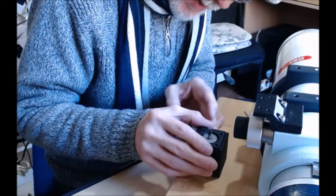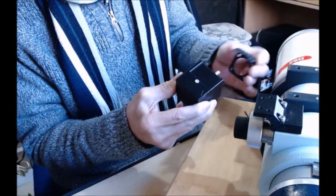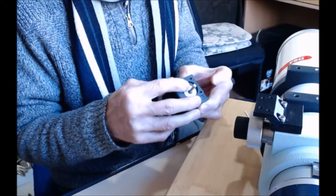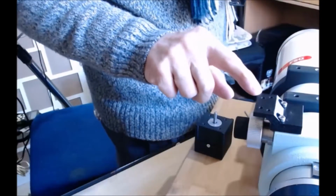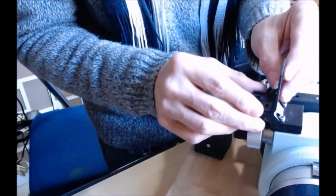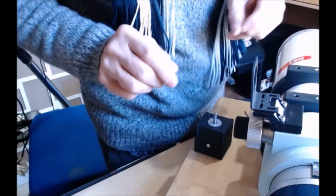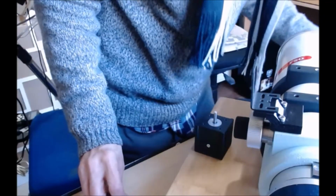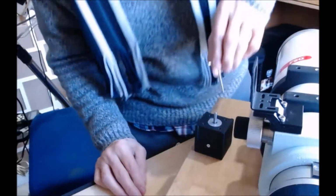Looking at that, there's a groove on the actual motor unit, a slot there, so that tells you that has to go in there, I should imagine. That would indicate to me that we have to put this bit on here first. And if you look on here, you should be able to see there are four drilled out or processed holes. They'll only fit on one way, so you can't really go wrong. You have to marry the slots up to the holes, and you need a tiny 2mm hex key for this, because Pavel supplies 8 little screws, one of which has just disappeared.